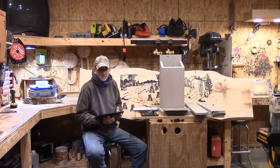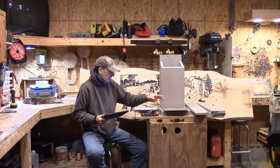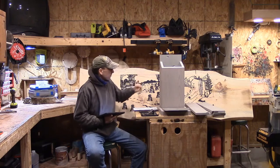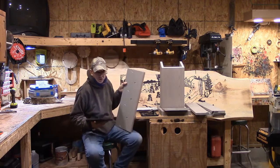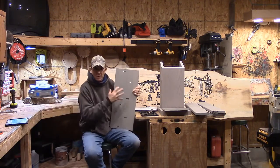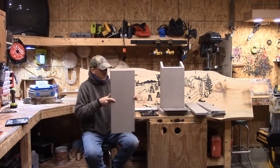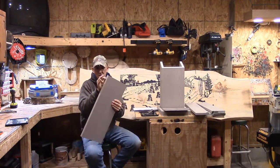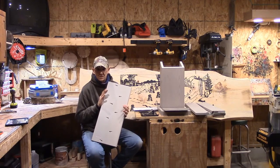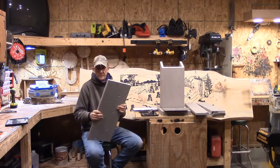You can paint or stain the exterior and seal the outside — it'll last for years. Do not apply anything to the interior. If birds come inside and smell adhesives, paint, or caulking, they're probably not going to use it — and then a squirrel may come along, chew a big hole in the front, and now you've got a squirrel house. On the back of these, if you want to add more traction for smaller birds, you could staple a piece of wire screen on. This is just two pieces of five-quarter decking board with a nice clean radius edge. I didn't use any adhesives, silicones, or glues — nothing that the little birds could smell and be put off by.